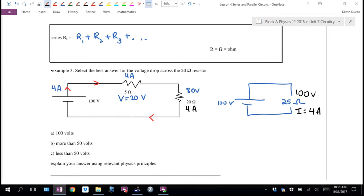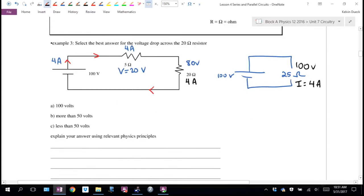So what's the correct answer, A, B, or C? B? Explain your answer. So look for total current first. Look for anywhere you know 2 things next. And if that doesn't work, resketch the circuit as its simplest form. And it's a sketch. I'm not going to be fussy about getting all the symbols right. In fact, sometimes I won't even resketch it in its simplest form. I'll do an intermediate sketch, and that's enough that I can see where I'm going and get the rest of the way because I'm lazy.